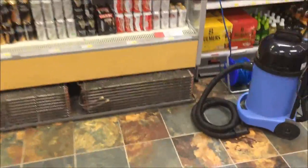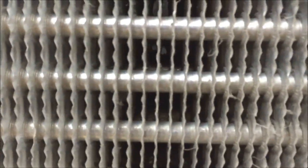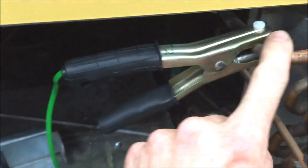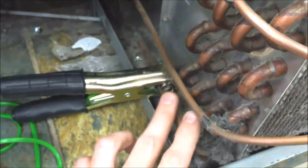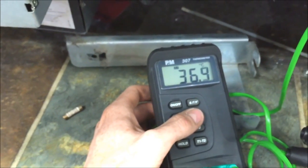So I checked the condensers — from the outside they don't look that bad. But as soon as you're looking inside, it's pretty bad. You can tell the top of that has not been done for a while. I put the sensor on — this is straight from the compressor, so it's really hot, showing 68°C. The pipe going in is 68 and the pipe coming out is 36, so there's a difference of 34 degrees, which I don't think is very good.